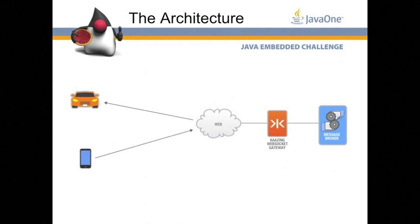The way we connected the browser running on the phone to the truck through the public internet is with the help of the Kaazing WebSocket gateway and a message broker. In the world of enterprise messaging and JMS, a message broker is a very common concept — the idea is a PubSub model. In our case, the phone is publishing data: turn on the light, turn left, turn right. Those messages are sent through the web via the WebSocket gateway to the message broker, which routes them to anyone who has subscribed — in our case, the Pi sitting on the truck. So over the public internet, we are controlling the truck using an HTML5 web client, running Java code on the Pi, and ultimately driving the truck.